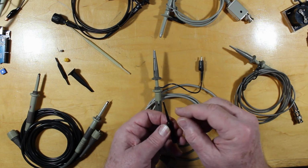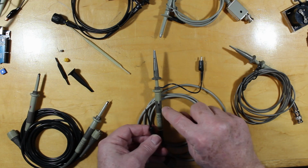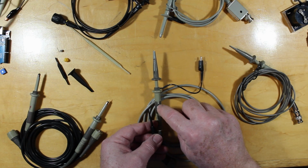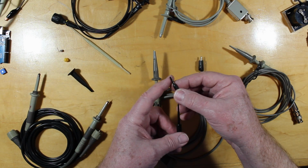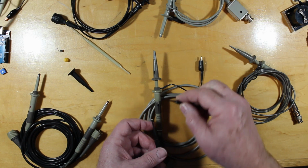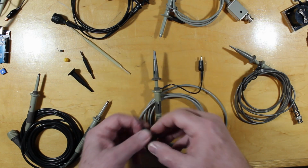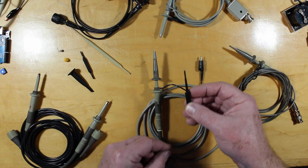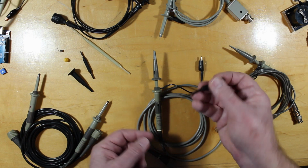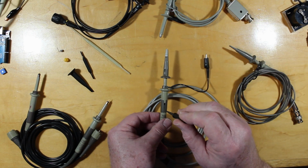Now you'll notice this guy here has a very small end on it that is metal. That's because sometimes these can get a little bit difficult to turn, and simply using just a plastic one like this, you might take the end of it off because it's that tough, and these wear out really quick. So they'll put a tiny bit of steel or whatever in the end of this, and the rest of it's plastic. And then you're not loading that thing down on the inside when you stick this in there to adjust it.